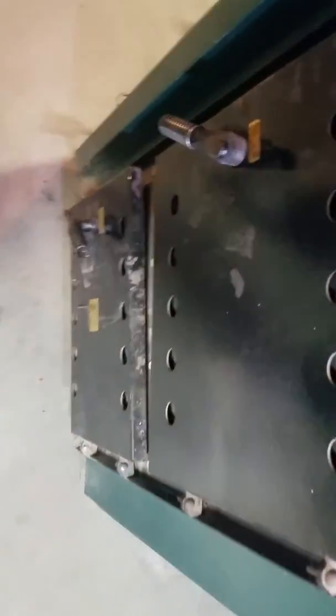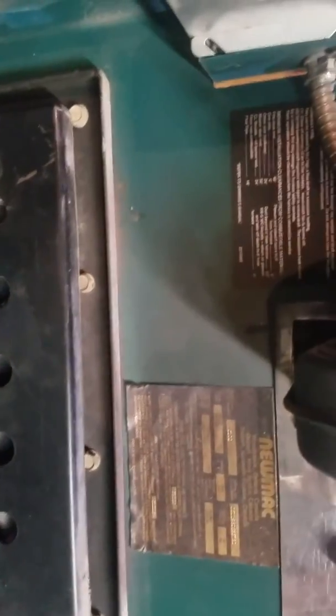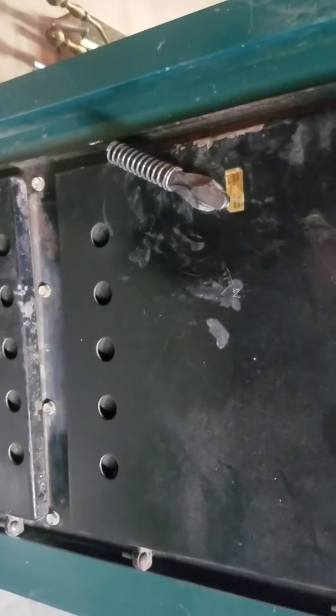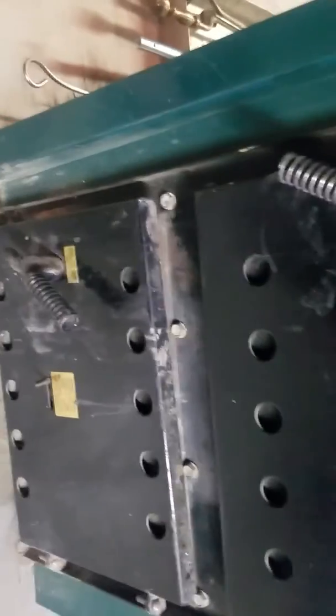One very important note: if you're going to burn coal, it is critical that the appliance that you burn it in is approved for coal. Coal will get too hot. If it's only approved for wood, you run a high risk of actually burning it out, literally melting your appliance. So please consider that. This is down in a basement, concrete floor.